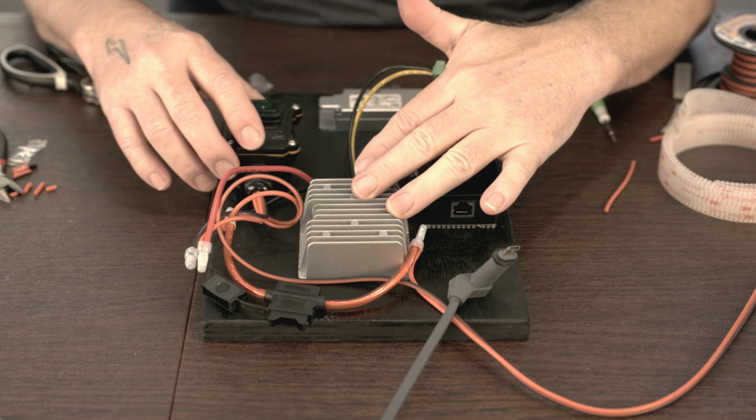All right, so as we discussed earlier, Dishy has a specific configuration it requires for power over Ethernet, and it's non-standard. So in order to get that to work, we're going to have to put new ends on these cables, and we're going to have to swap a couple of the pairs so they match up with Dishy. We do that going into the PoE injector, and then we do that coming out of the PoE injector, so the data pairs are actually still in the correct order. They have to be, or it won't communicate, but the PoE will get injected onto the correct pairs.